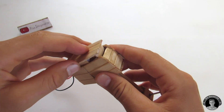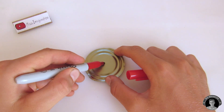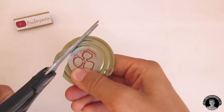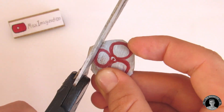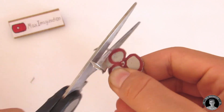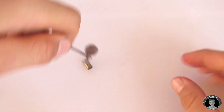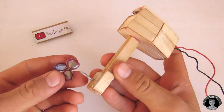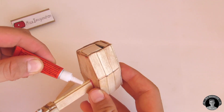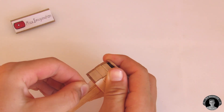Now let's make the motor's propeller from the bottom of a can. Poke a hole in the center of your propeller and make sure it slides onto the small shaft sticking out at the bottom. I found that the best method of attaching the propeller onto the shaft is just to solder it, and it turned out to work really well. Just below the engine's base I glued on a couple of right-angle shaped popsicle stick pieces, and now we're done with the panga boat outboard motor.